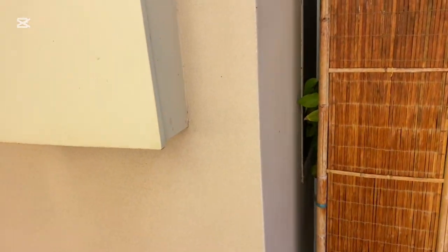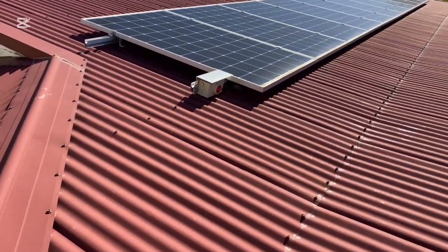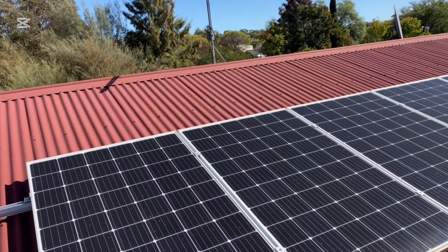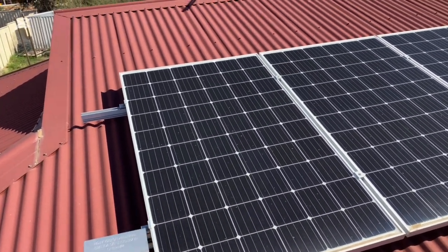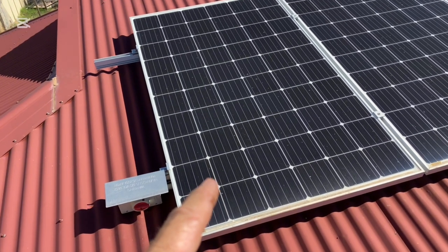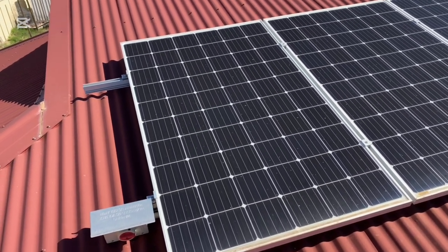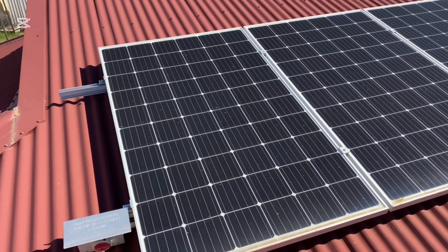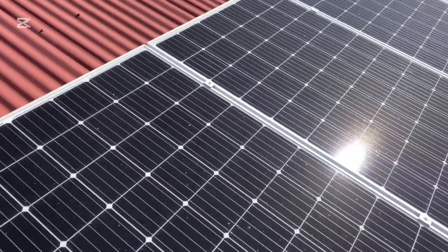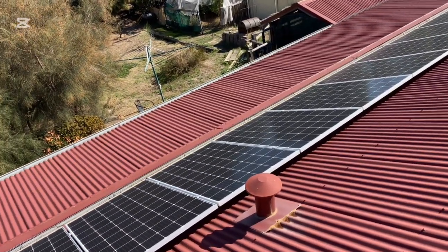In the course of doing that, I've had a look at the solar panels. The solar panels are okay. They are what's called Opal Solar, which was Solar Juice's own brand — Solar Juice being a distributor and wholesaler in Australia. These are just a rebadged Astronergy panel, which is a mid-range panel — nothing flash. They were delisted from the Clean Energy Council approved products list, I think in 2021, due to a power output issue where the output didn't correlate with the claimed output. Either way, they were delisted. But the panels are all good — nothing wrong with them electrically — and there's no water ingress, snail trails, or anything like that. So they're all good.